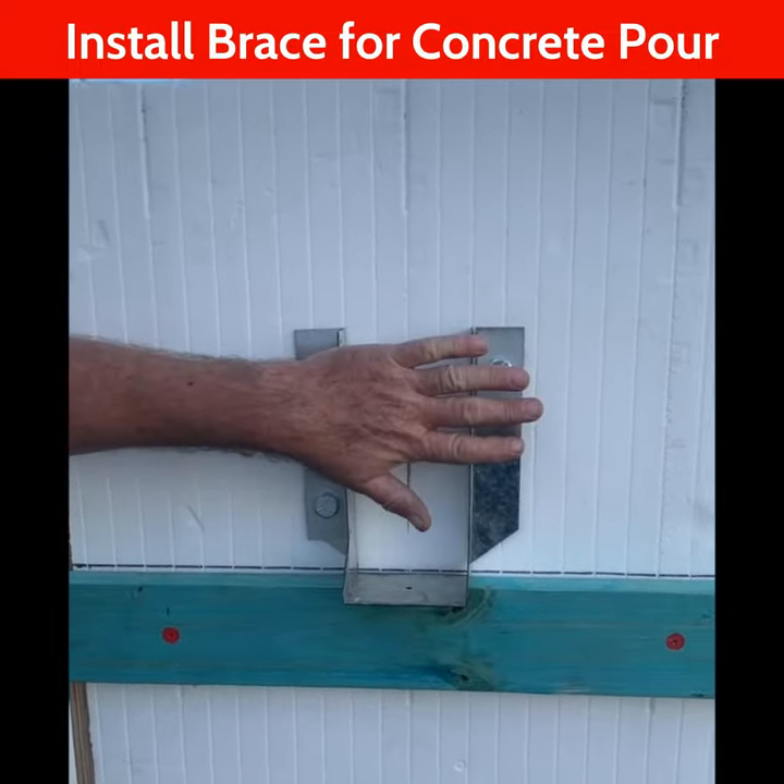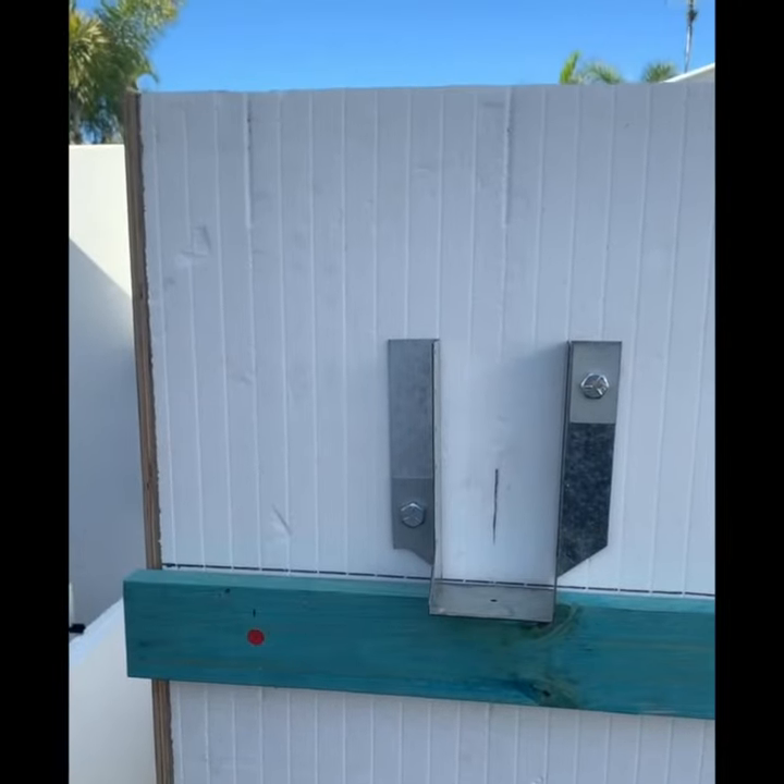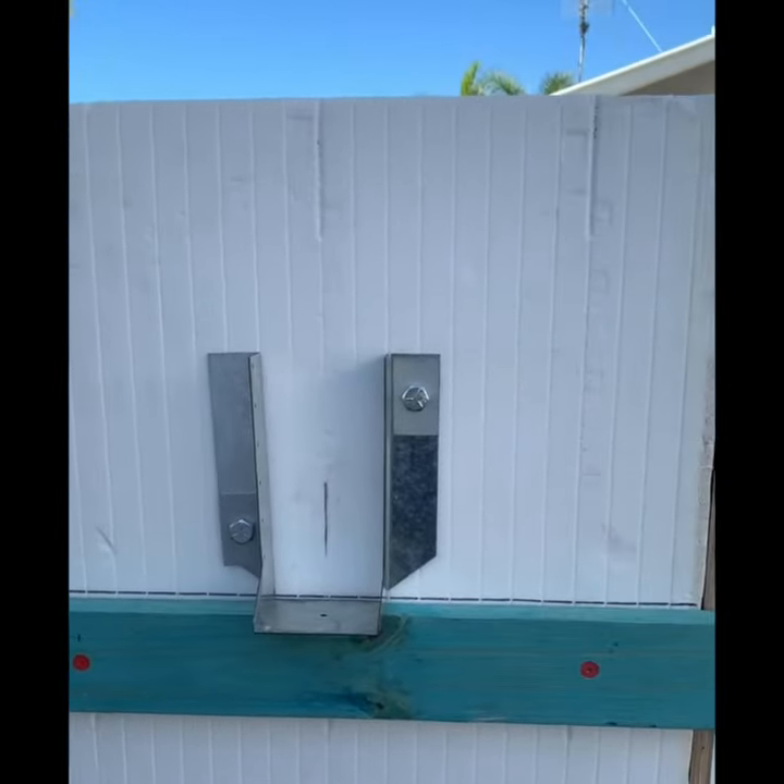This is a tip for on-site: you get all your joist hangers set up and then you can screw a piece of timber through underneath them all. That way it keeps them more in the same spot.